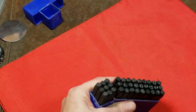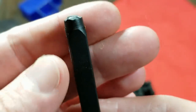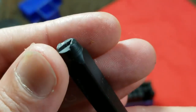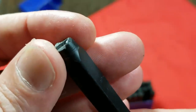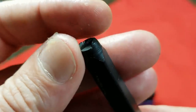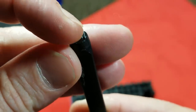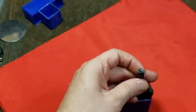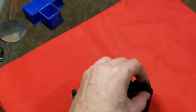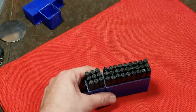Some of the issues you get with a cheaper set — we'll take a look at the Z here — is when they chamfer the ends they don't do a particularly good job. You can see where they overdid it, right there, so it's real sharp at the bottom and it doesn't get quite as good of an impression at the edges of some of the characters. A nicer stamp set would have better quality control in that area.